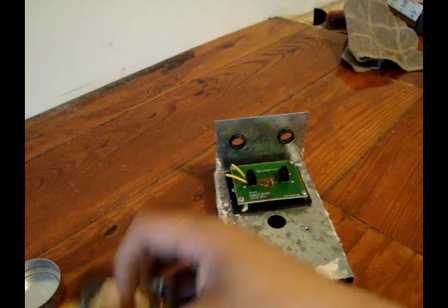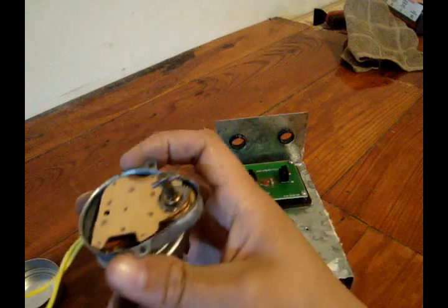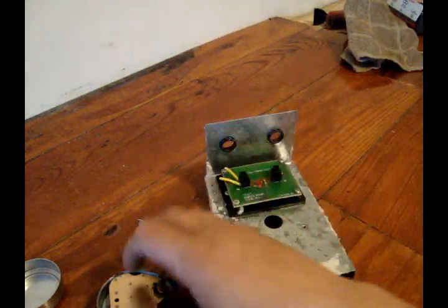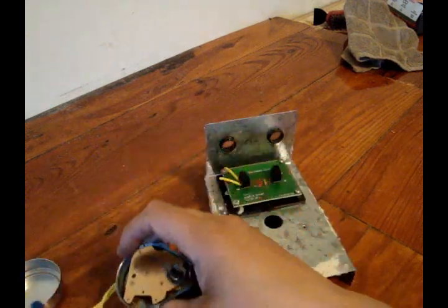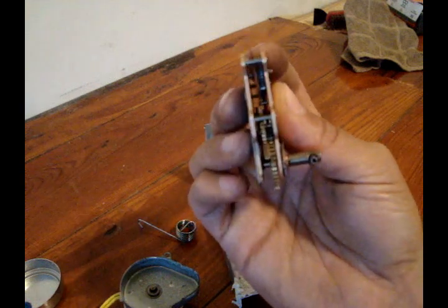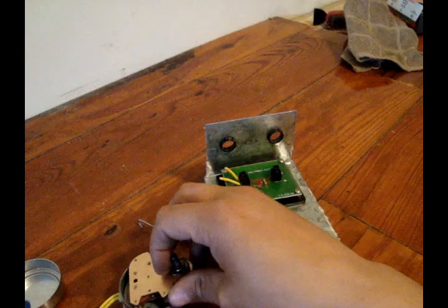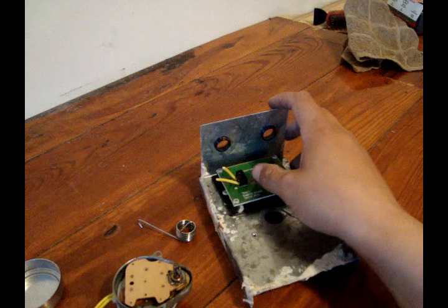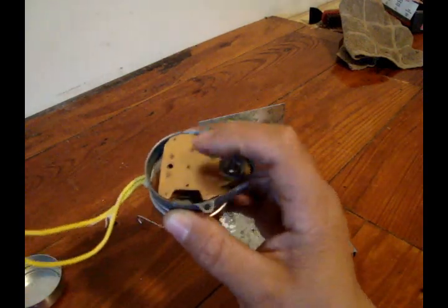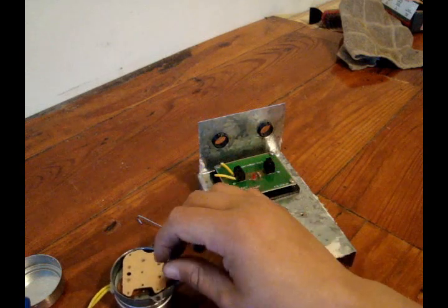This is all encased in the motor, so if you have a ZoneX, when you change out the motor you actually change out all the gears — the whole nine yards. Just leave the damper in place, and you have to reuse this board. I'm not a big fan of ZoneX, so we actually went back in with a Honeywell. There are a lot less working parts with the Honeywell. The more parts you have, the more chance of failure. The Honeywell is a lot more simple, a lot less to it, but does the same exact thing. Similar problem is why the Honeywell fails too — if the gear gets stripped out. But on this one, if you have to, you can just change the motor. My personal opinion: I'd put in a Honeywell and be done with it.